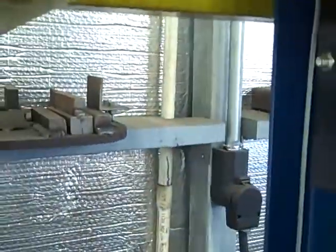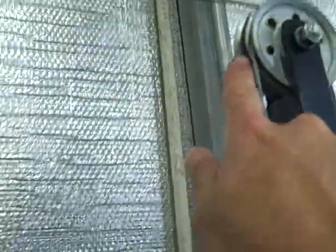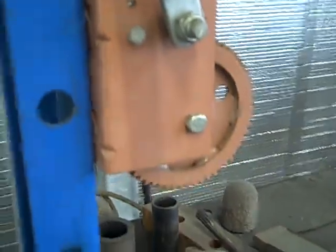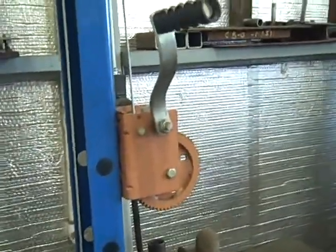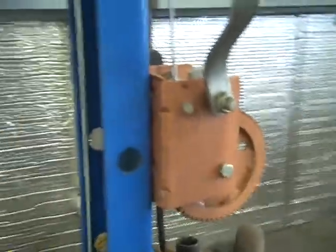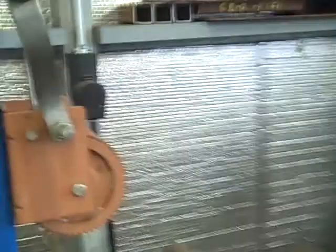The rope will come up and make the loop just like we're doing here, back down to the center of the bed. There we'll put a turnbuckle and bring the wire back up, move this second pulley out and then bring it over and down, affixed to the bed. That way it'll be self-leveling, and you'll only have one cable riding up on the winch itself. Keith Verner's bed design is really nice — it's chain and gear driven with gear racks. I've thought about it and that system may still happen someday, though it's probably a year or two off. It's a lot more complicated, but a lot smoother. This wire rope system is a lot cheaper, but not as aesthetically pretty.